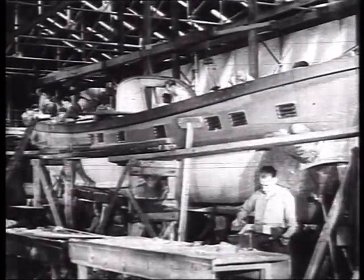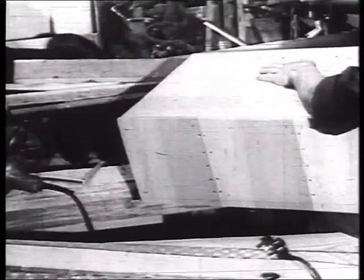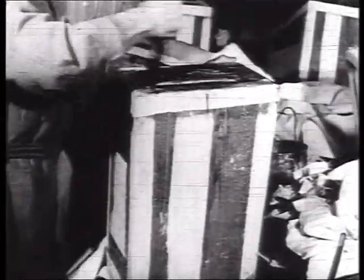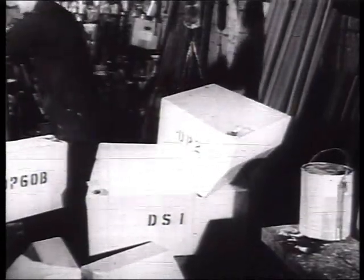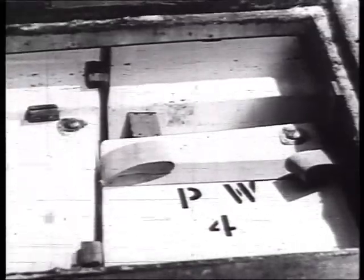All the unused spaces in the hull of a lifeboat are full of air cases — empty boxes full of air. There are so many of them in each lifeboat that, however badly damaged, she will never sink. Made with great care to exact measurements, the cases are glued and covered with calico before being painted, varnished and numbered. Then they are stowed away into position under the decks, spacing bars keeping each air case from touching those around it.